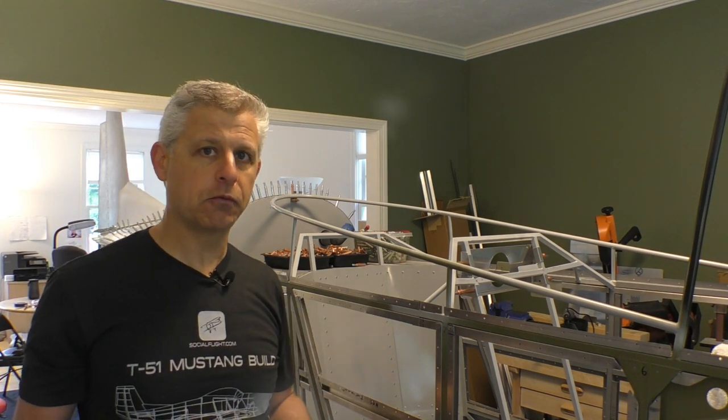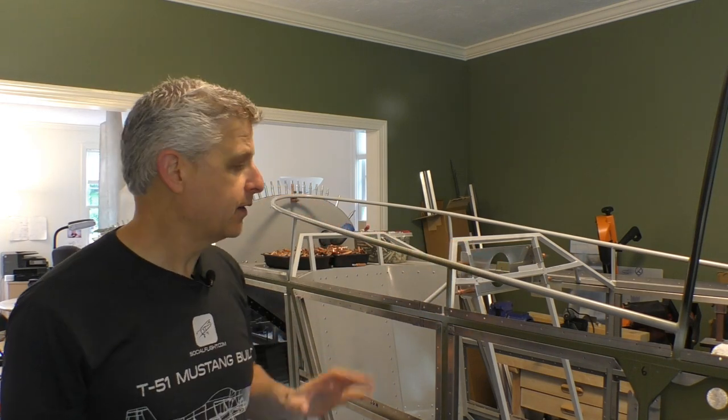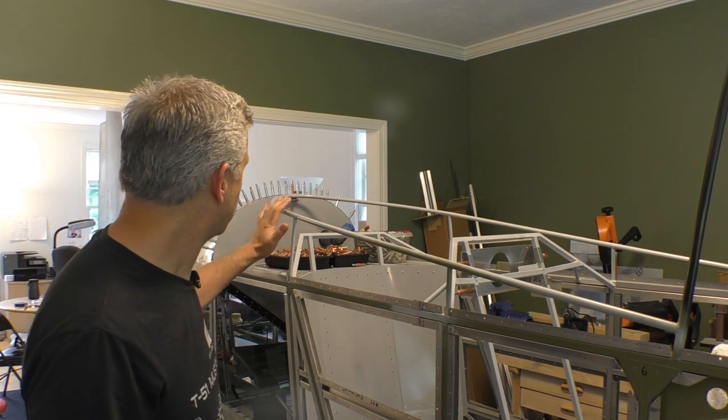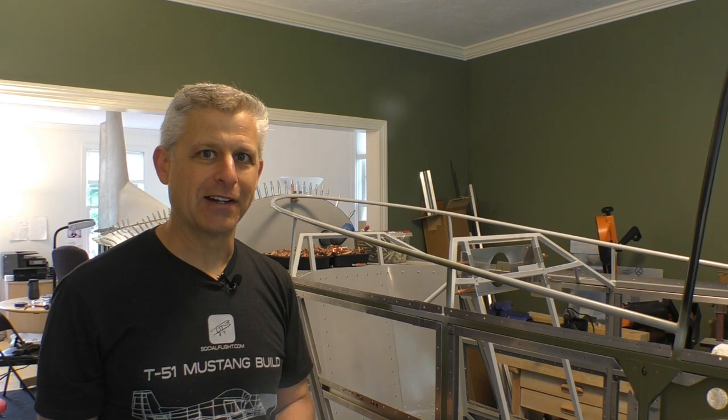So a lot of different pieces come together right along this rounded bar. This is all the structure that's made out of steel, and then all of the sheets that we put on here and all of the rest of the hardware are going to be aluminum. We need to start by actually cutting out the raw shapes of metal that are going to go onto here from a flat sheet of aluminum. So let's get started.